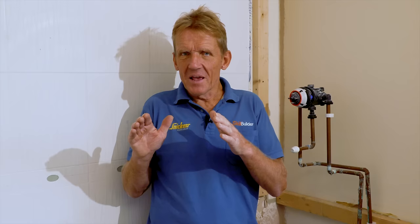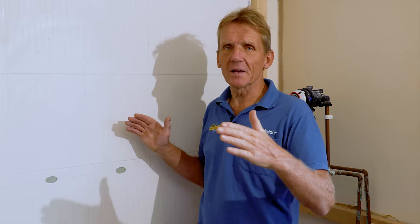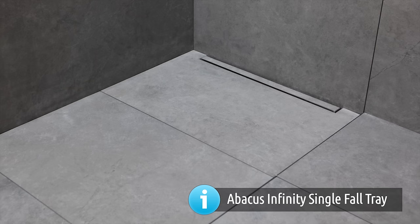If it's just a little bit tight on a joist, you have the option of packing the wall out very slightly - maybe 20 millimeters - to move the tray over. We've got room because it's an 800 tray and we have easily more than 900 millimeters. If that doesn't work out, another option is a wet room former; Abacus Bathrooms will actually make one so the waste comes exactly where you want it.